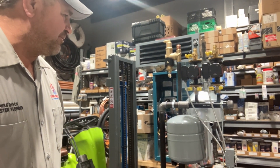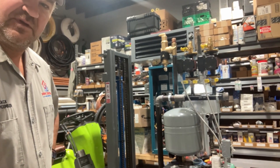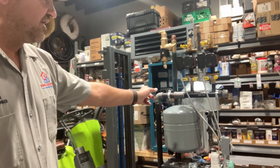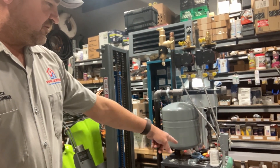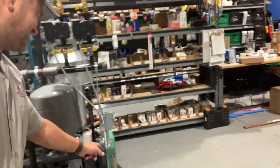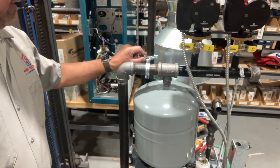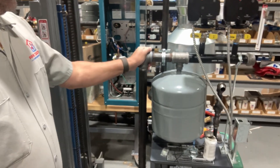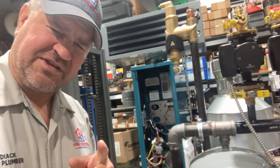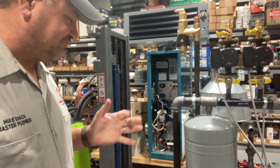Then we got back to the shop and we installed the threaded rod, as you can see. We got that inch and a quarter split ring hanger on the end of that return manifold with some threaded rod to the top right side. And then I put an inch and a quarter and a one inch split ring hanger here with a piece of threaded rod. So now it ain't going nowhere. I'm still going to wipe off the pipe dope off of the threads — do you guys wipe the pipe dope off your threads? I typically do, it's a nice little added touch.